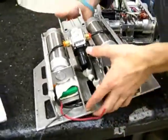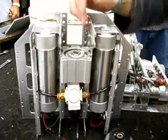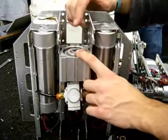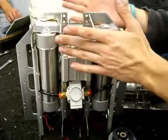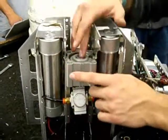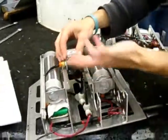Next, we needed a piston. This piston has 153 pounds of force at 65 psi. It only has about a 0.8-inch stroke — we'll call it a one-inch stroke. We're using a lever to make it so our flipper will move four inches. Stroke is how far it comes out — the distance it extends.